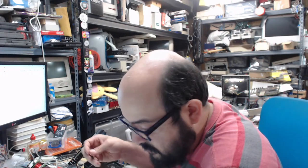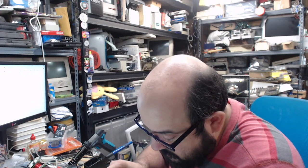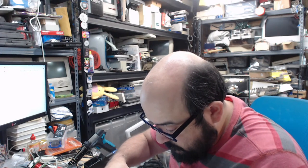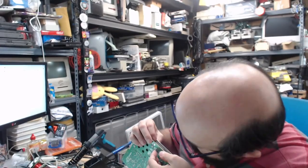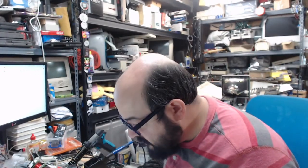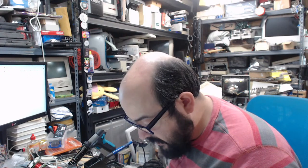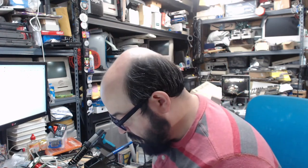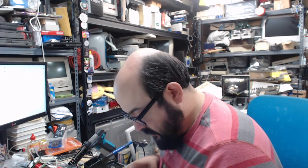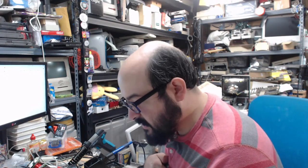That's a 1 microfarad. Oh, that's a U. I'm an idiot. So that is CP34. Let's put you in there. Alrighty, just do that section again. Positive, negative, negative, negative, negative, negative. I'm just making sure the polarity on these caps are correct, because that's very important. Excellent! We're all negative and positive in that order.